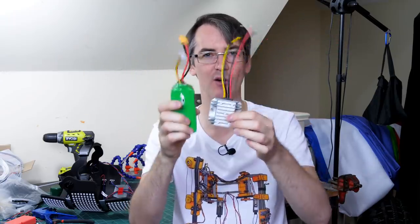So in this project, we're going to limit the current to 10 amps using one of these regulators and power it off a normal LiPo that can go in my other pocket or somewhere, or probably on a belt clip. And that means that we can limit the total current to basically a third of the brightness of the total of the LEDs if we were to turn them all on full brightness, and that'll happen dynamically, dealt with by the FastLED library.